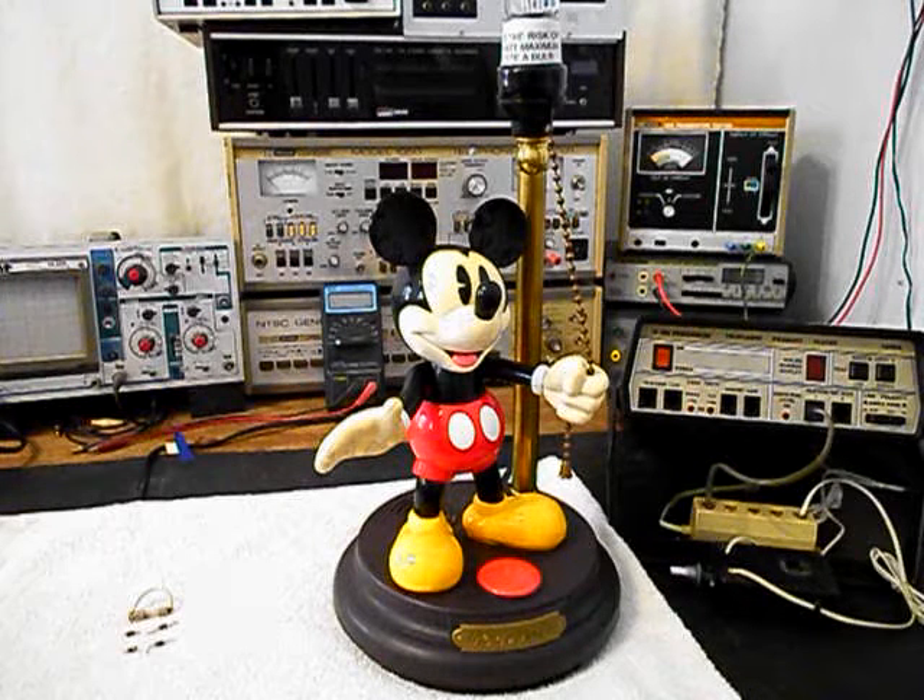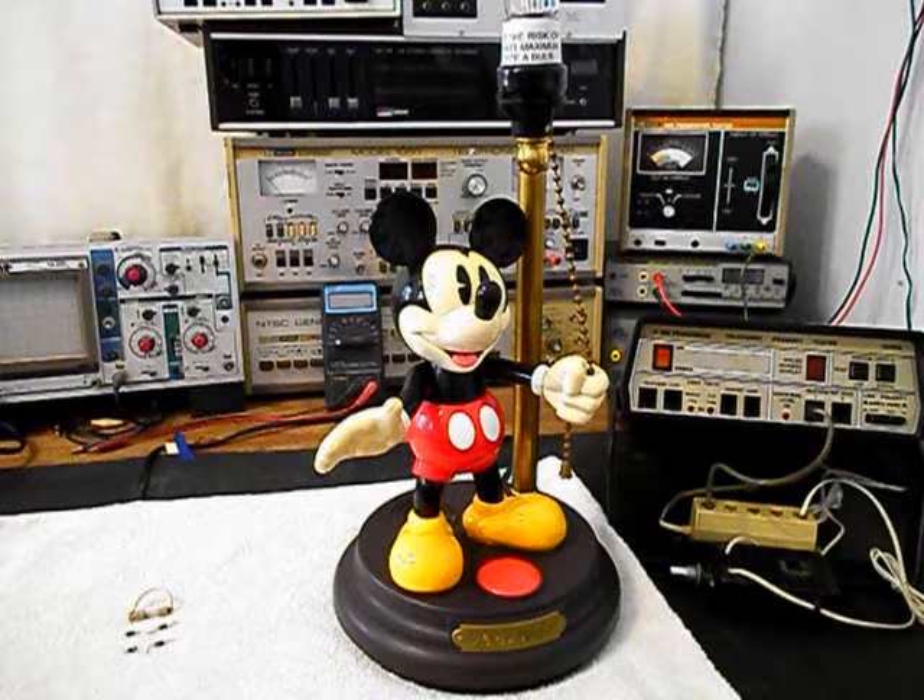The company that had this lamp for repair tied a short across the main fuse, and it looks like they blew a trace out on the main PC board. Mickey had low voltage but did not have high voltage, so basically the animation was working but the high voltage for the light bulb was not working. We also found that the socket for the light bulb was totally disconnected. Probably the repair company couldn't figure out exactly what was going on, and for whatever reason disconnected the light bulb socket — which in return probably saved Mickey from further damage by taking the load off the light bulb. So Mickey has been through a lot of issues, and now he is repaired.